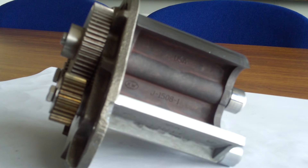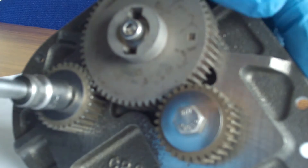Causes of damage include over-speeding of the meter — i.e. beyond the manufacturer's designated maximum flow rate — failure of the strainer basket as previously stated, and overheating of the meter. This can be caused by allowing hot liquid to pass through the meter as a result of the dedicated attached pump being allowed to run on full bypass for too long.